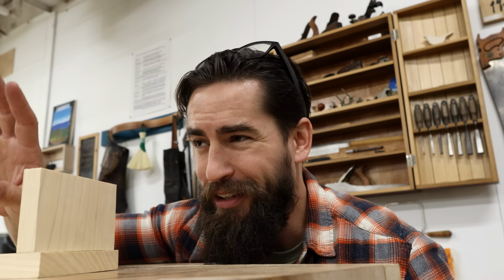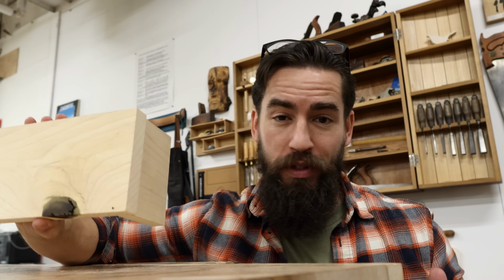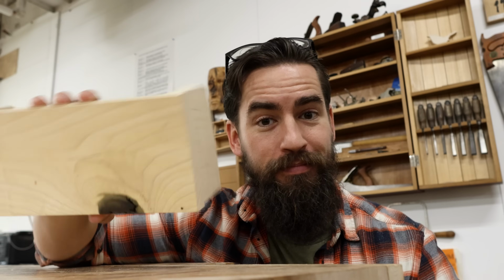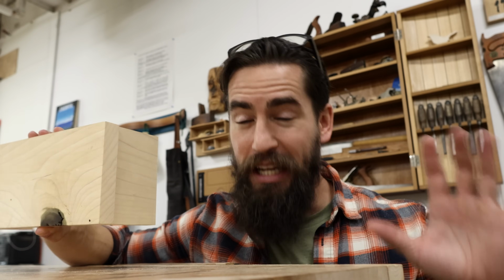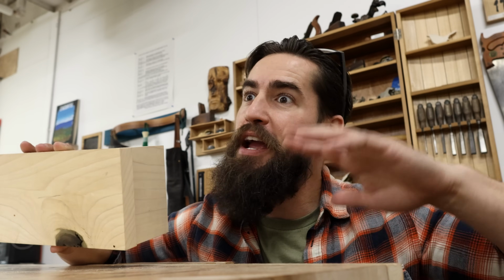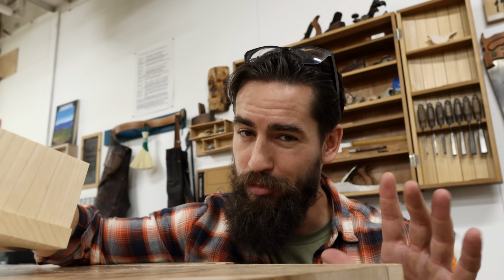Now, briefly on aesthetic applications, because that's no small part of the conversation on this channel. Usually, when I'm making a cabinet and this is attached to the top and the bottom, I do a stopped joint, because there's no real benefit, in my opinion, to putting through joinery on the top and bottom of a thing when very few people are going to see it. So I usually just stop it. Also, these days, not the biggest fan of through joinery, though it does have its place.